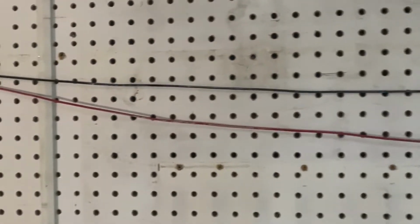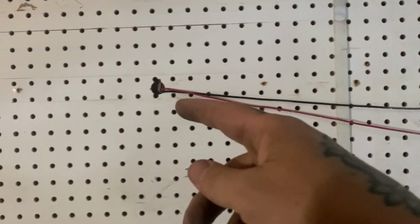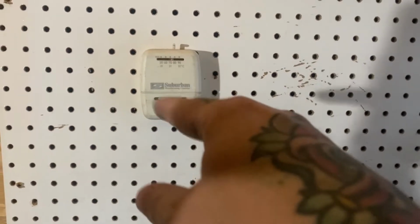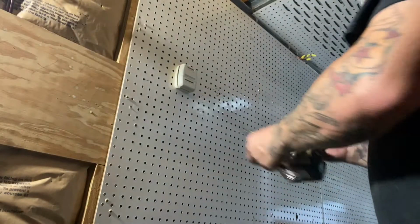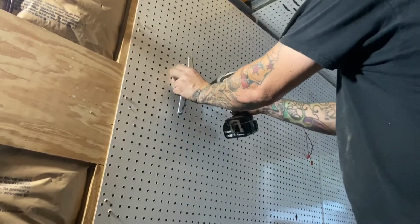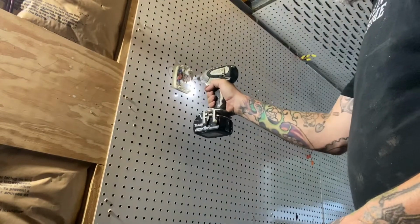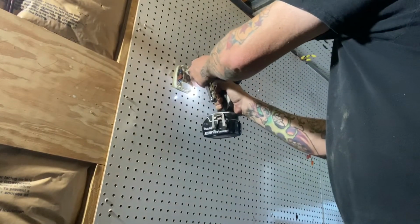Okay, all those LEDs are connected to there. I believe they're connected. They go through there, connected to here. So I'm gonna cut these two wires and cap them off and shove them through there because I gotta pull off this panel. First I gotta disconnect this thermostat. All right, so remove this face plate off this thermostat. And then remove this. Peek at what the wires look like.